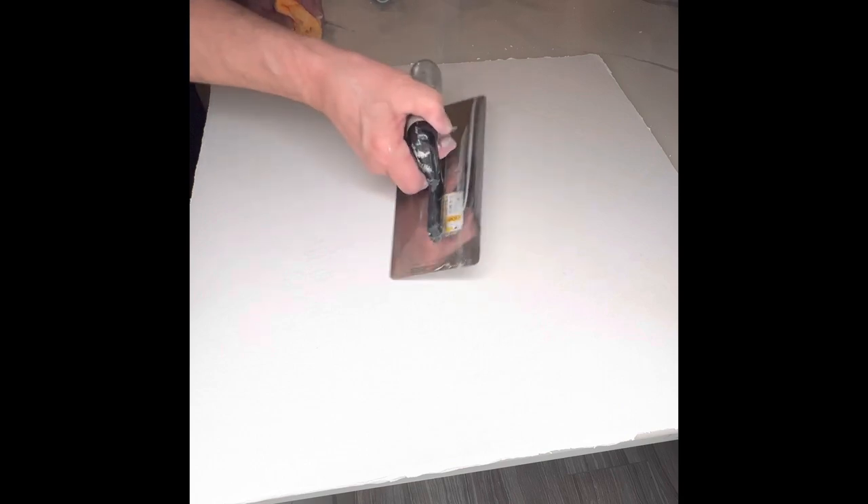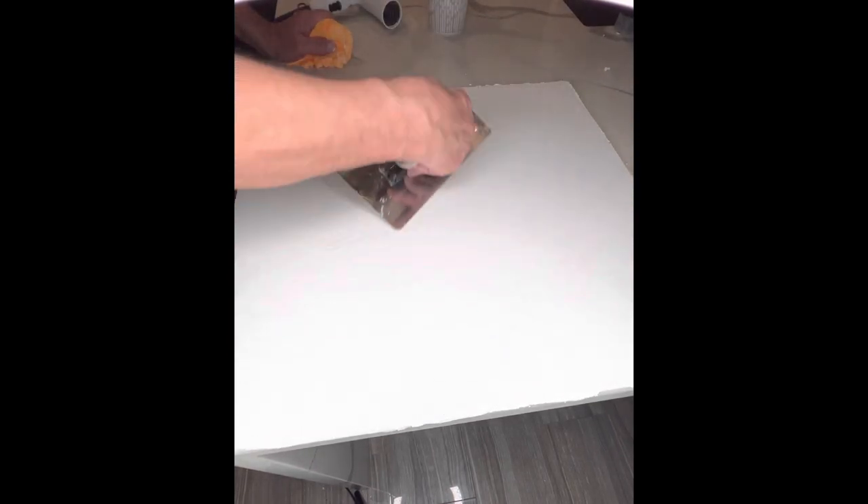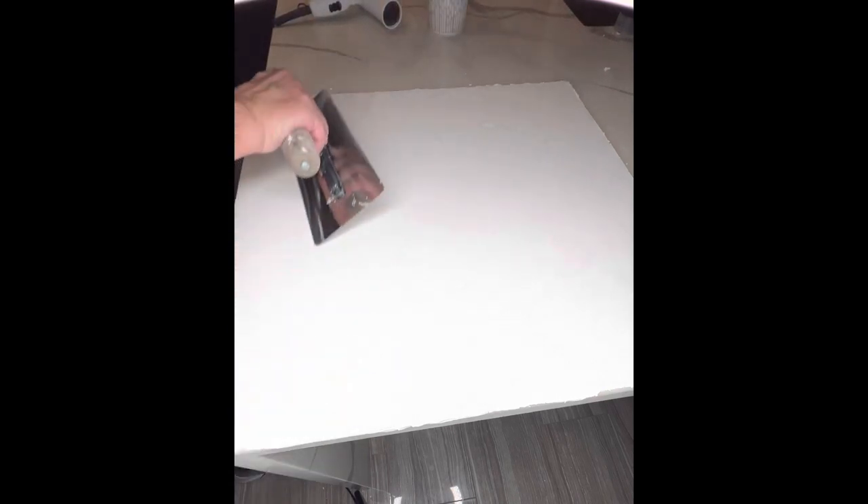Speed up the drying a tiny bit and give it one real quick pass — I threw a little warm air across it just to move it forward. Keep your trowel clean, run it from all directions, perform some compressions. Now it's dry so I'm just going to give it a quick final compression to get what we call that little sheen. That's it. And what you're going to see on it is a slight angular sheen — a very simple view of that with lighting to kind of see what that actually looks like.